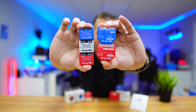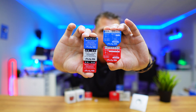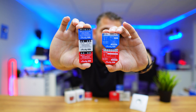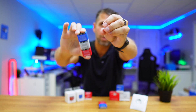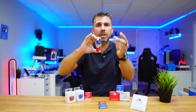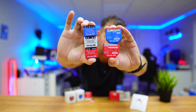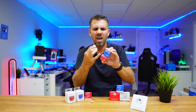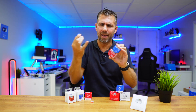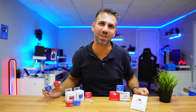Connection-wise they are all basically the same. The biggest advantage of the regular versions is that they have more connection points on the live and neutral, whereas the mini versions only have one of each because they are smaller. With the smaller ones you may need to add connectors to get an extra neutral or live wire, while the regular versions don't have that need. The advantage of the minis is their smaller size, making them easier to fit in outlets. I've been using these for years in several projects and they fit fine. Hope you enjoyed the video — thumbs up is appreciated. My name is Roberto George and I'll see you on the next one.